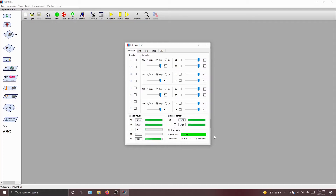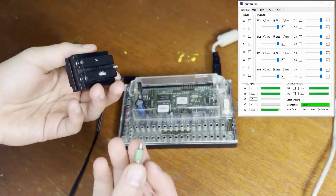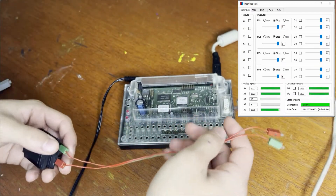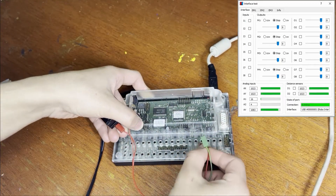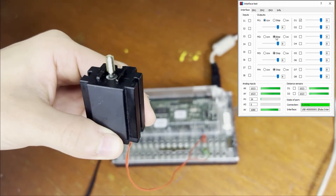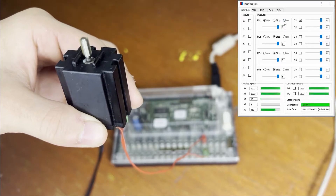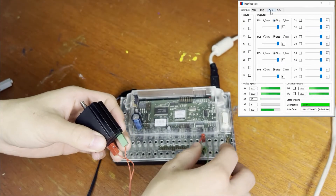The first thing we're going to do is connect a motor to our interface and see if it actually outputs correctly. Take a motor — this one might be broken, so make sure you test with multiple motors to confirm it's the motor that's the problem and not the interface. Connect two wires to it and find the motor ports on your interface. Place the two wires connecting them. The order might matter when you're actually building it. On the interface test window, press Clockwise, toggle the speed, press Clockwise again — and stop. The motor works fine. You can test the other motor ports if you want.